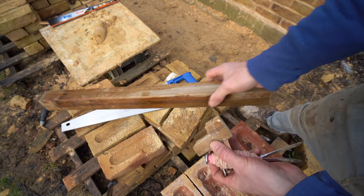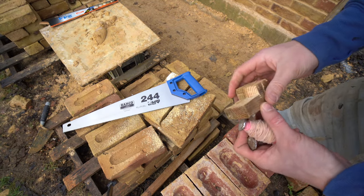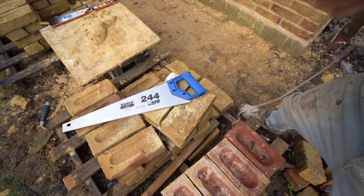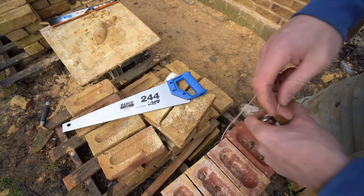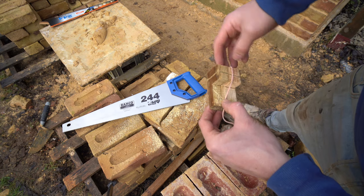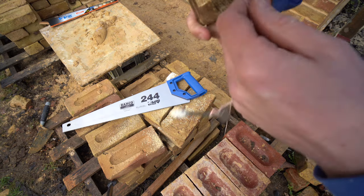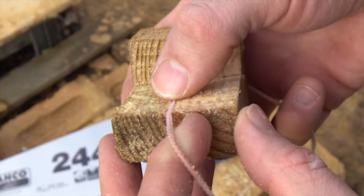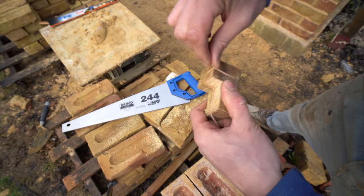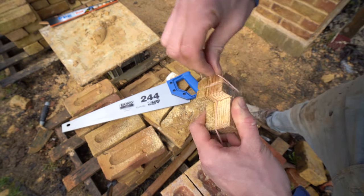And with the amount left over on that bit of wood, I could make enough for me, Gary and Phil — so they ain't gonna be nicking my corner blocks anymore. Just to show you how it works: much the same as any other corner block. Your line goes in like that, that groove holds the line nicely so it'll be just up against the brick. The excess out the back you just wrap in those little grooves, much like you would with a normal corner block.